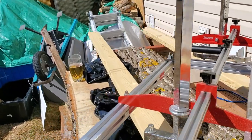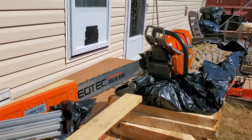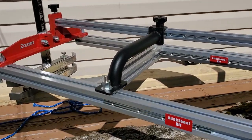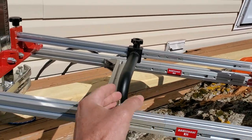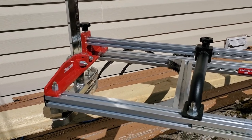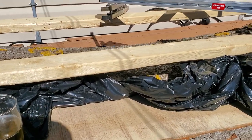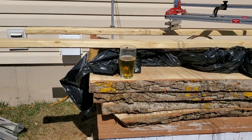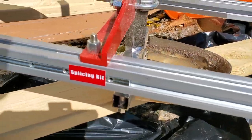I do plan on doing a pile of planks with it. I'll put a smaller 24-inch bar on this 92cc saw, and it'll go fast through a piece of spruce that's only about 20 inches wide. The mill will adjust down to here, the handle moves over, and I'll have the power head hanging off the end — it would rip through very quickly. Each cut on this big log averaged about 10 to 15 minutes, but that's somebody who doesn't know what they're doing and isn't in great physical shape. I had to take quite a few breaks. It is a real workout — this is not an easy job.